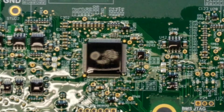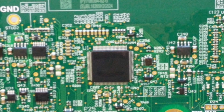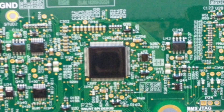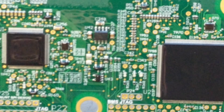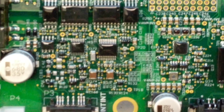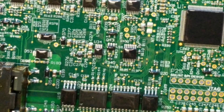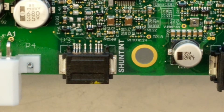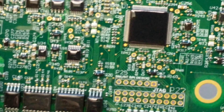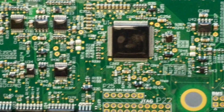Then there's another little processor over here. This is a TI DSP — part numbers in the description as well — and this is what they call the high voltage processor. It kind of deals with the control of the contactors. Both processors affect safety, so either one can order the pyrofuse to open. In addition, the pyrofuse is hooked to the current shunt with hardware such that even if these processors were completely absent from the board, the pyrofuse can be blown if there's too much current going through the shunt. A gross overcurrent will blow the pyrofuse instantly, and you can also tailor the trip curve in software if you want to blow it sooner — for example, if the inverter fails — to avoid damage.